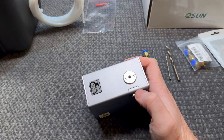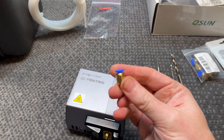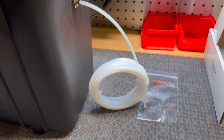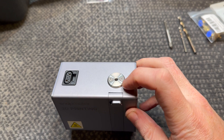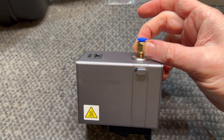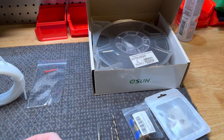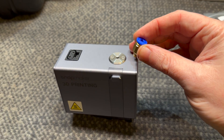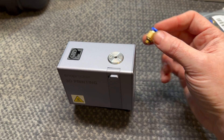I thought I'd do a video on this just to see if it does work, and we'll fly by the seat of our pants. What we need to do first is modify the top of the print head so we can fit these little springy compression fittings that hold the tube in place. We're going to drill out this hole, tap it, and we should be able to mount this fitting in the top. This modification doesn't really affect the printer in any detrimental way — the hole can just stay in here even without a tube attached, so I'm happy to make this and leave it permanently.